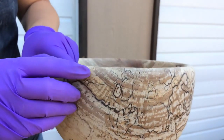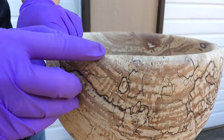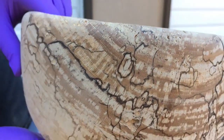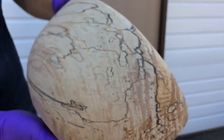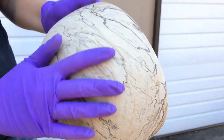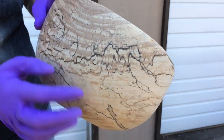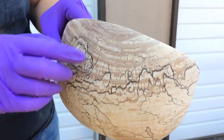And you'll see that, so this is sycamore and it has large rays. You can see the ray flecking. And here you see that white ray. So a fungus was in there, took out the lignin. There's a lot of white rot through here. And again, up through here, you can see those bleached rays.